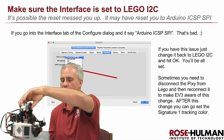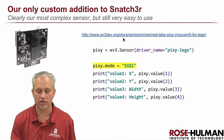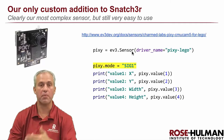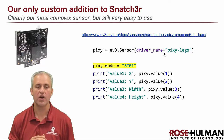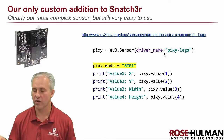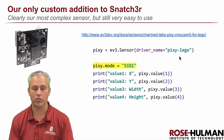Let's talk about how you use the Pixie once you've trained a color. The code looks like this: `pixie = ev3.sensor(...)` — this is the first time we've used the sensor class, which is the parent class of all sensors. We're specifying the name of the driver, which is a bit unusual. The reason this one is different is that the color sensor, touch sensor, and IR sensor are very common so they have special classes. The Pixie camera is less common and not made by LEGO, so there's no special class — but you can use any sensor by specifying its driver name.